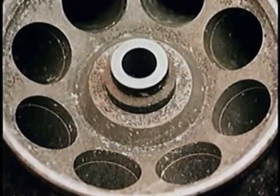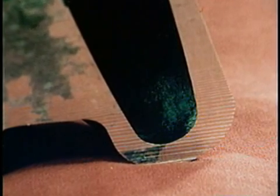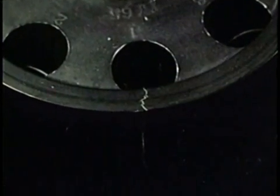What all users of centrifuges fear most is rotor failure. Centrifuges and rotors are designed to withstand enormous forces, but the integrity of rotors can be seriously compromised by corrosion or fatigue. In aluminum rotors, structural failure is most often caused by surface corrosion in the highly stressed areas of the rotor. Metal fatigue is an inevitable consequence of prolonged rotor use and will eventually cause any rotor to fail.